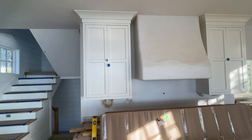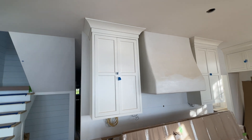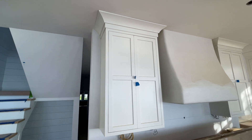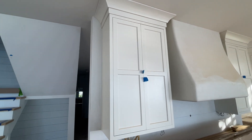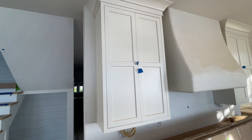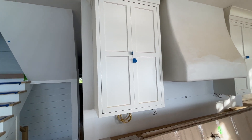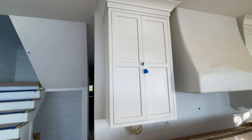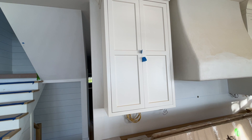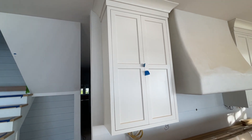When we do our crown molding, we like to use cove molding, which has that flared-out look — it's a little more dramatic than a traditional crown and not as ornate, really a clean look. At the top of the cabinet, we apply a piece of flat stock molding, which is just a one-by-six. It can sit on top of the cabinet box or overlay the top, depending on what sort of reveal you want — the thickness of the layering on top of the cabinet.